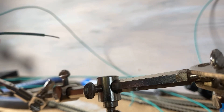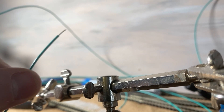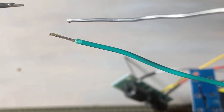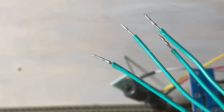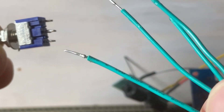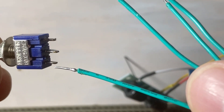For the power wire which will feed the switch, I'm using green this time. As always, I'm going to start by tinning the end of each wire. Now all four wires are tinned. You'll notice on the switch that there are three terminals, and each of these cables are going to be soldered to the center of each switch.